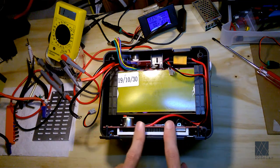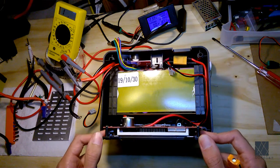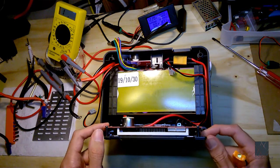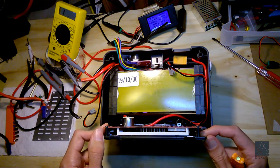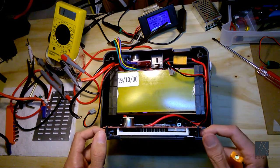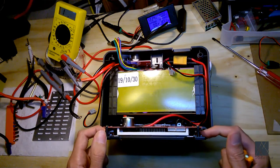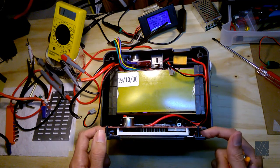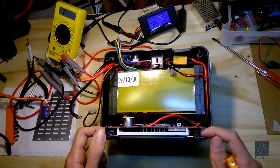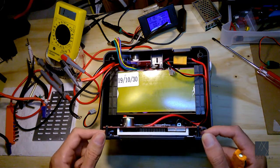Okay, so if you take this front panel out and disassemble it, use extreme care and caution if you power this board up, because one of these LEDs could come on without the lens, the diffuser right here, and hit you right in the eye when you weren't expecting it. You can damage your retina. Now that may sound ridiculous, but it's the truth. I've already had run-ins with LEDs like this before. High power LEDs are almost like a solid state laser, and you have to be very careful. So just be aware that that's the type of LED used here. They're not meant to be used with the naked eye. There's a diffuser here, that's this plastic lens. So just be really careful. Eyes are really valuable and you only get two of them, so don't mess them up.